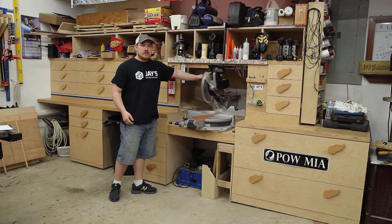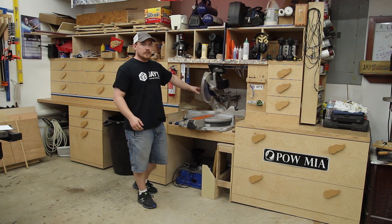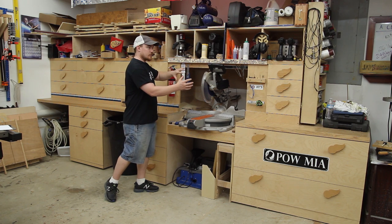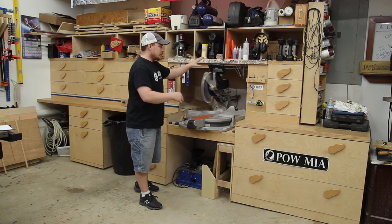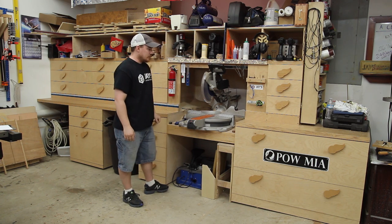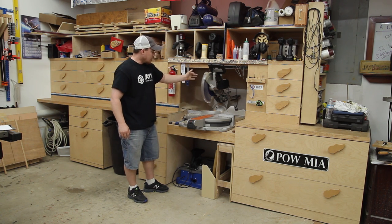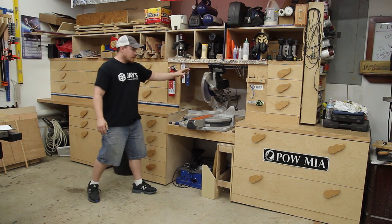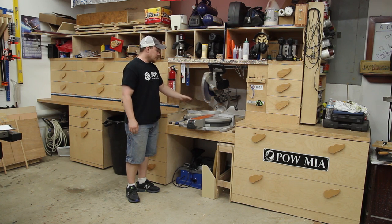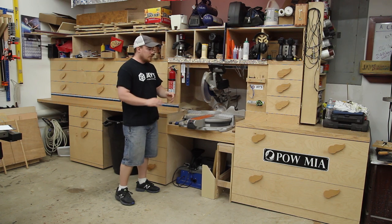What I have is a sealed-off dust collection box, and on the back bottom side is a four-inch dust collection port. Once the dust collector is running, it creates a natural draft to suck the air in. Any dust spewed up in the air from the saw naturally gets pushed back and sucked up by the dust collector. All the larger chips just go into the back and fall wherever they fall — it's a containment system.